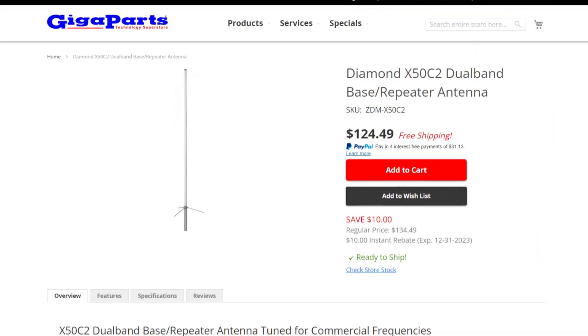The ground plane antenna is another option to build or buy. This can be a smaller antenna for VHF and UHF operating, or it can also be a 33-foot tall model to get in on some HF bands. Commercially, you'll see these as half-wave or 5-eighths-wave vertical antennas with smaller ground radiating elements. If you're trying to make simplex contacts or get into a repeater on 2-meter or 70-centimeters, a vertical antenna is your choice for cities or flat areas. You don't give up signal strength in most directions, and most repeater antennas are also vertically oriented.